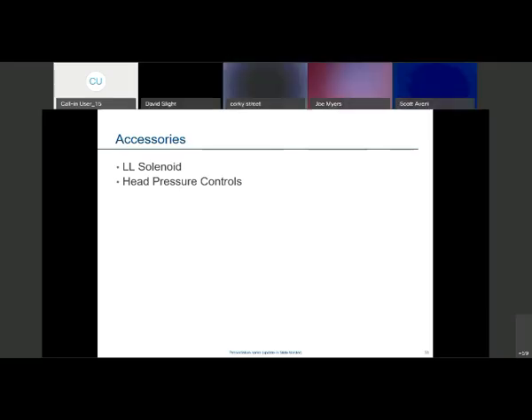These are different types of head pressure controls. Along with fan cycling switches, you try to maintain your condensing temperature right around 100 degrees. As it falls and rises with the fan cycling switch, that can play havoc with an expansion valve, so it's nice to have a mechanical control that actually holds the pressure back and maintains a steady pressure.